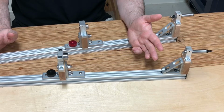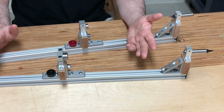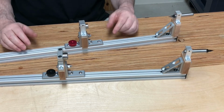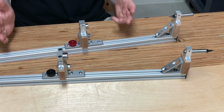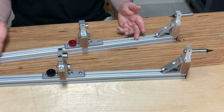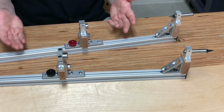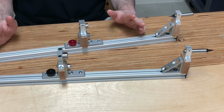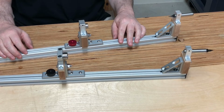And most importantly, this design allows you to drill blind spindle mortises from underneath. You might need that for a crest rail and even for other non-chair making operations such as casework, stairs, etc. And all this in a package that weighs less than 2.5 pounds. Now, let's move on to a short demo of the drilling guides.